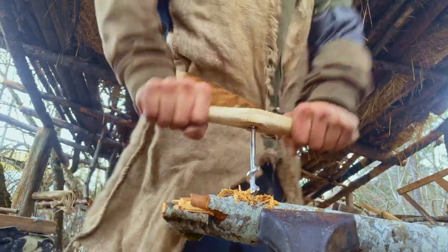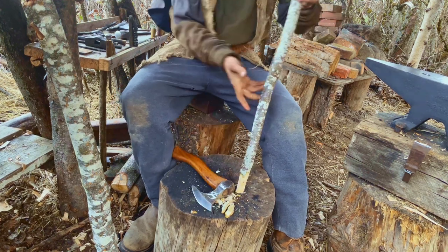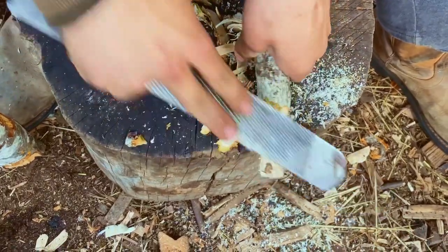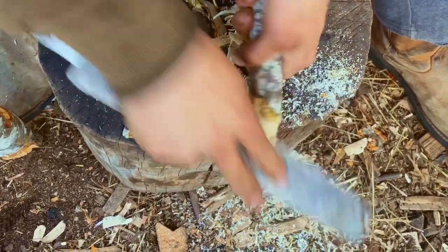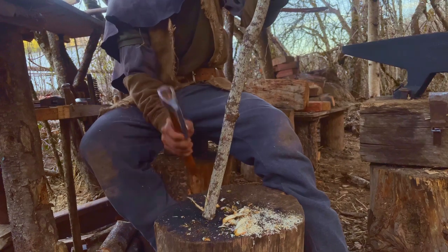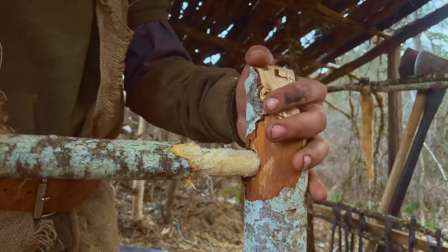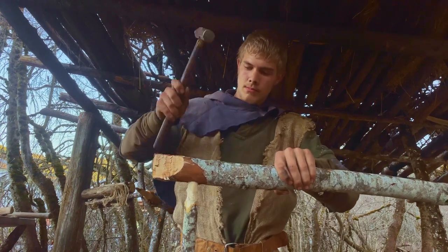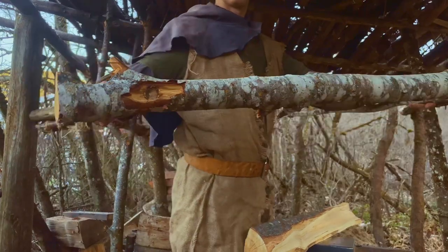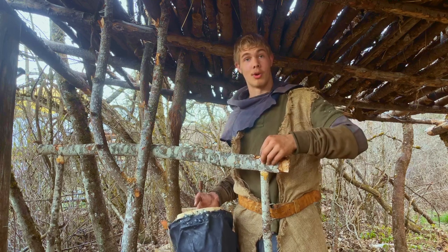In this part of the video we lost audio, but you can see I've now flipped it around and I'm drilling a hole on the other side of the beam. Here I am forming one end of the tenon, which I will put into that hole. Here I am fitting them together — they went together very nicely. Doing it again — they fit very nicely. You can see those mortise and tenon joints took pretty well.